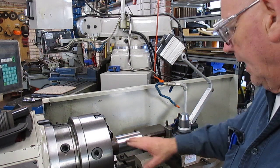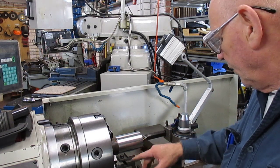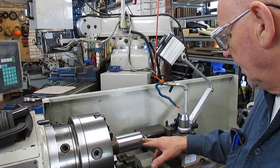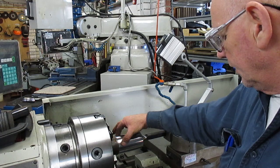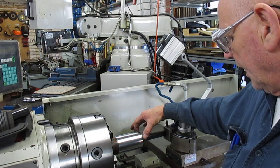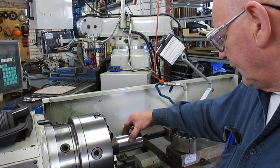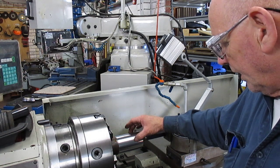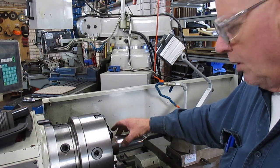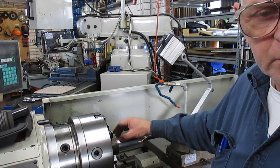What I'm going to be doing is machining through to the minor bore — the smaller bore that I need in the deep area — and then the larger bore after that. I'll finish that larger bore off to full diameter, and the smaller bore will be a little bit less and I'll be reaming it out.